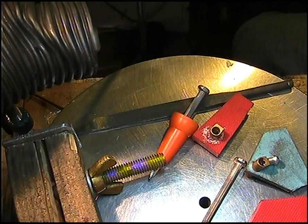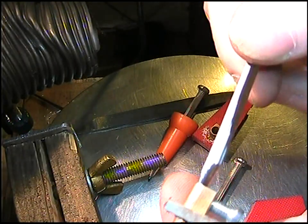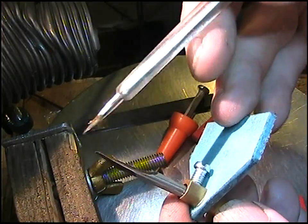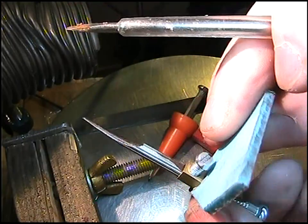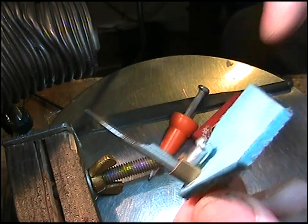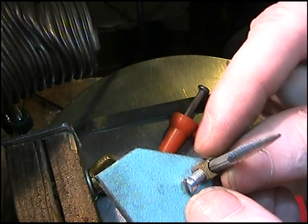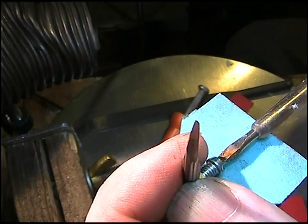So you've made your template and fitted your brass connector. The correct setting to get that angle from this surface to the tip needs to be 30 millimeters. You need to file or grind that area flat so that it's at 30 mil, then just put the screw down. These aren't perfect, but this is just to get you started. The angles to sharpen aren't that difficult, but when you start it's kind of confusing and you're never quite sure if you're right.